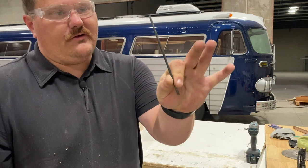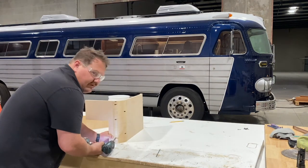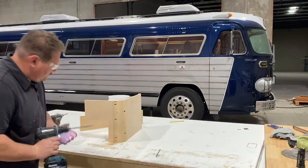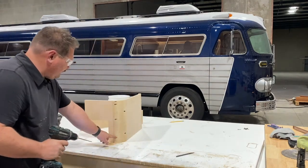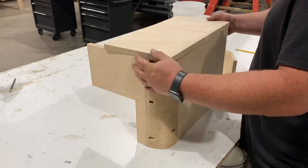It's a two-step process: come in about three-quarters of an inch, drill in about an eighth — just drill through the first piece of plywood, you'll feel it kind of pop into the next one, and that's when you stop. A scrap piece of plywood right here, put everything right where we want it to be.